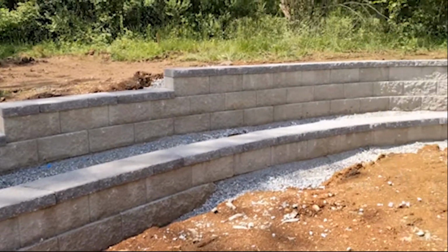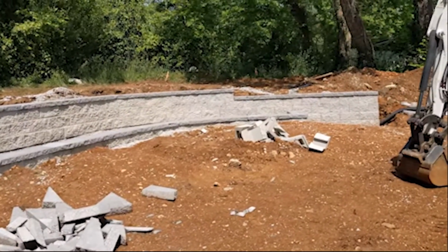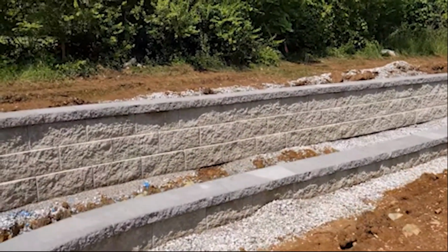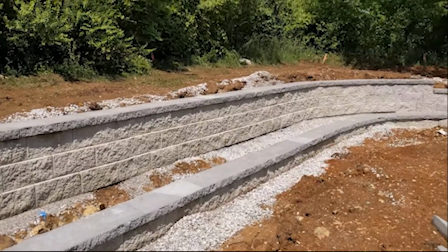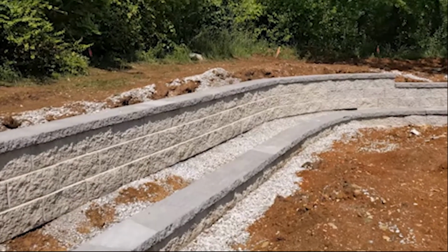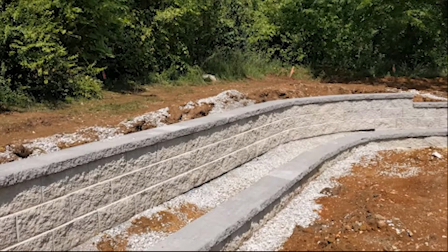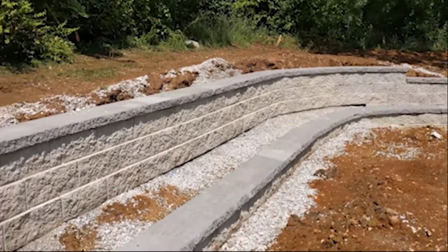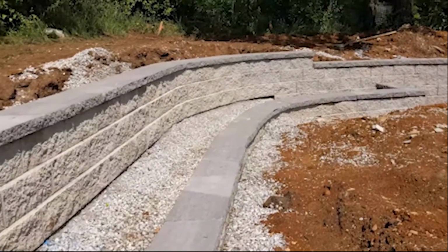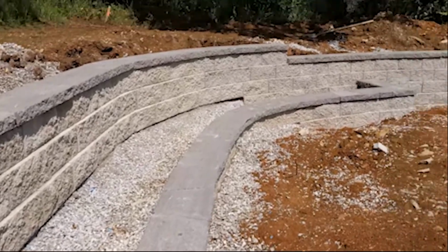And this planter bed that runs parallel with the back wall all the way through, that's very valuable space, and it's functional. The reason we did that primarily was to keep the fall distance under 30 inches, because by doing that we avoid having to put some sort of hand railing or safety devices on the top wall, which would have been an eyesore. So we wanted to avoid that, and we have, by building this beautiful wall.